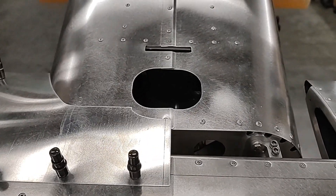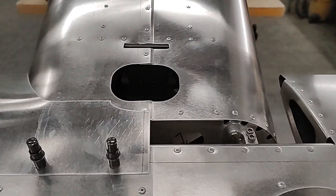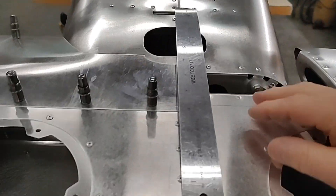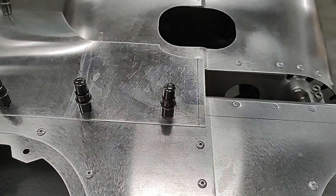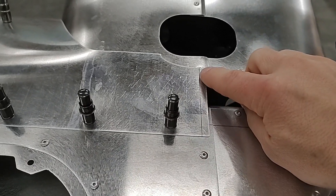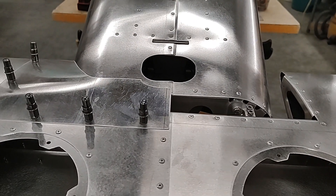The final reason why it makes sense to install this now is we don't have the vertical stabilizer and the rudder in the way of the center line. It's very easy while you have both fairings on — I have one removed just so you can see — to take a straight edge and mark a center line from the rivets that come along the middle seam and your horizontal stab right here. It's easy to mark the center line, trim the fairing, do the same with the right side fairing, and fine-tune them until they butt up flush against each other. That's our video tip for today — I hope this helps, thanks for watching.